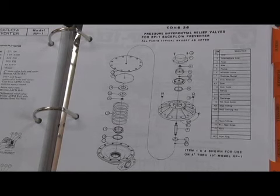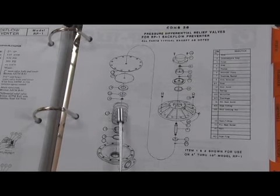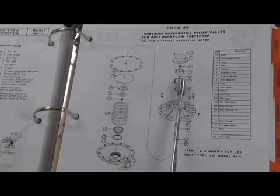And the 2-inch CDHS-20 fit on the relief valve on models 4 through 10-inch model RP1 and RP1EX. So although the size would be different and larger on the larger sizes, the construction was basically the same, with the relief valve seat, spring, diaphragm stem assembly, and the rolling diaphragm on the top, which operated as a guide.